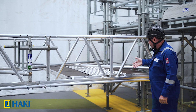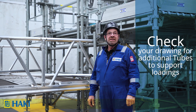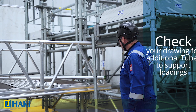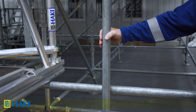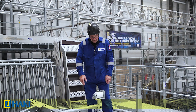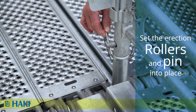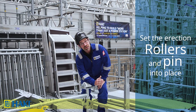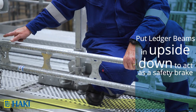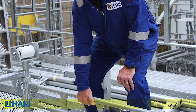On the first section we'll deck it out because this is where we're going to build safely from. According to the design drawing, if the bridge is longer or the support bays are wider, we may need a supplementary tube attached to support the ledger to take the load. On top of the birdcage standards we set the erection rollers and pin them into place the right way around, ready for the bridge to roll across. We also put ledger beams in upside down, coming upwards, so we can use these to anchor the bridge in place and act as a safety brake.